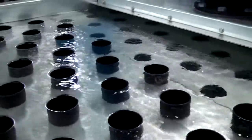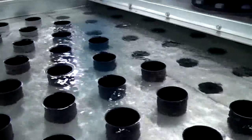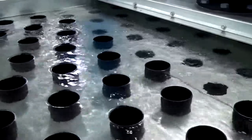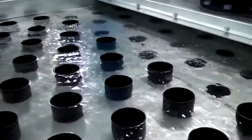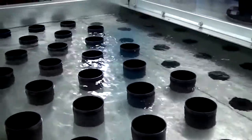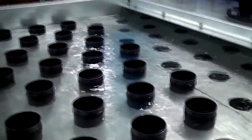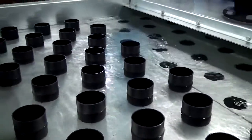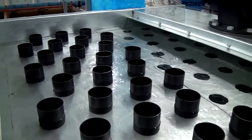At about this point, we are at about 50% of the design flow and still have uniform distribution on the louver face of the fill. Since this water has been pushed to the louver face, this would prevent icing happening on that louver face and saving the tower in potentially dangerous conditions.